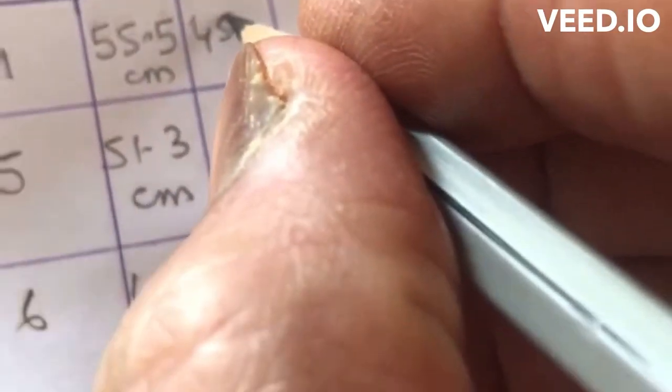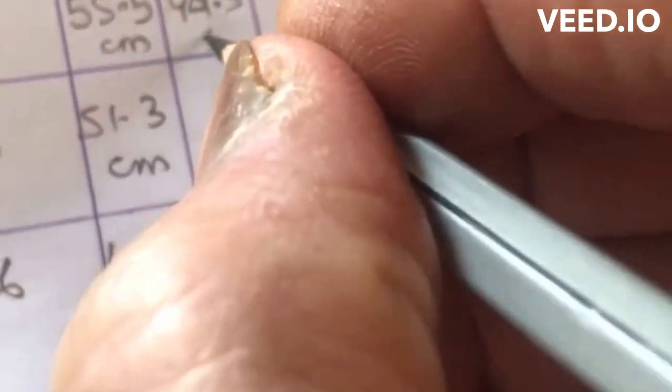Now let me temporarily put it off. Let me put that off as well. Now, why have I not calculated Ly here? Can anybody think of it? That is because it is a meter bridge. So whatever is the Lx, 100 minus Lx will be your Ly. Fine. So if this is 55.5, 100 minus 55.5 will be 44.5 centimeters. So accordingly, you can all convert this and write down. I have written it down.